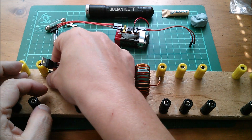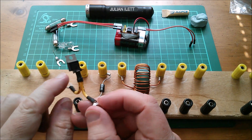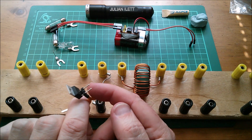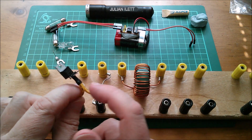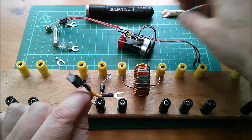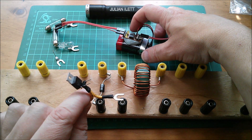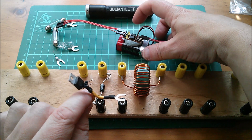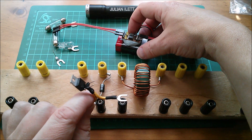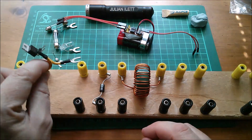Further work to do: I need to make some more of these MOSFETs with thick wires on drain and source and little DuPont-style Arduino-type connectors on gate and source, so I can switch the MOSFETs on and off using these MOSFET drivers. I need to make another one of these — I might use a different opto-isolator, the NEC 1201 or 2501 or something like that. See if they're any faster than these Sharp PC817s. Eventually I'll need four of these when I've got four MOSFETs.